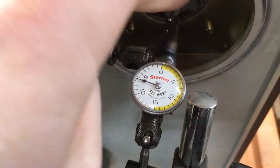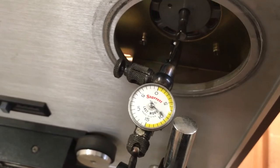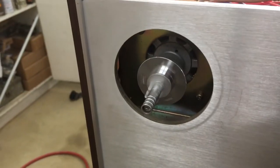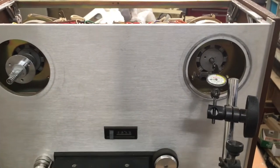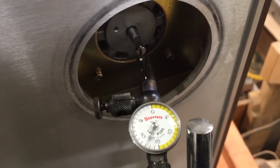But let me show you — I thought possibly that motor shaft was bent. To me, that looks like evidence that it was smashed into something at some point, and I was right. I've got about 15 thousandths runout on that, which isn't great. This side seems fine, so I think just this side got knocked at some point. Yes, indeed, we do have a problem. That's not a good amount of tolerance, as far as I'm concerned.